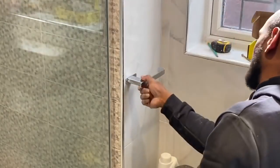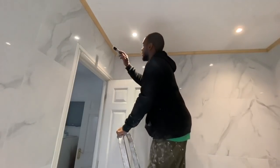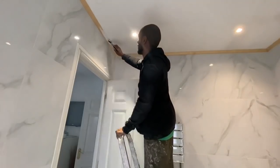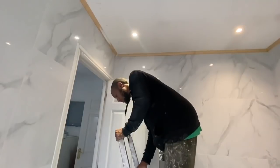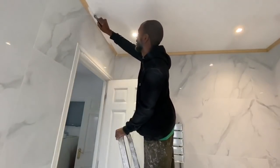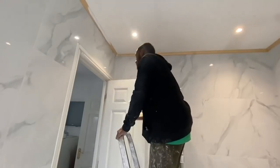And a tip for them is don't let them overheat. If you let them overheat, they can burn out very quickly. So have a small little cup of water or something, and after you've drilled for a couple of seconds, dip the tip into the water, let it cool down, and then drill for a few seconds and dip it again. Just keep dipping it in.